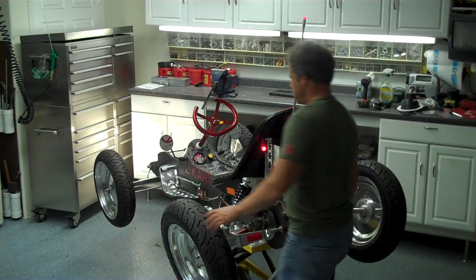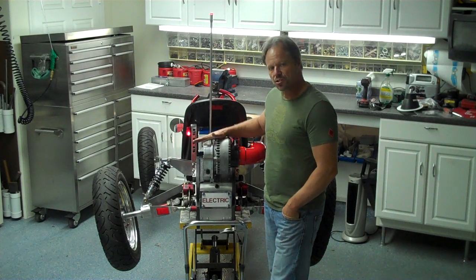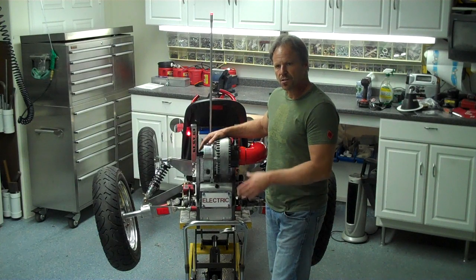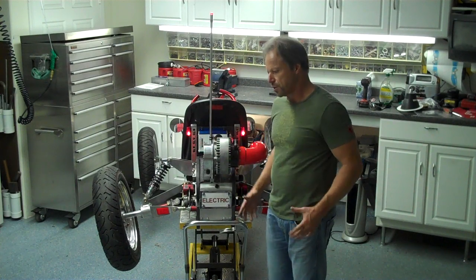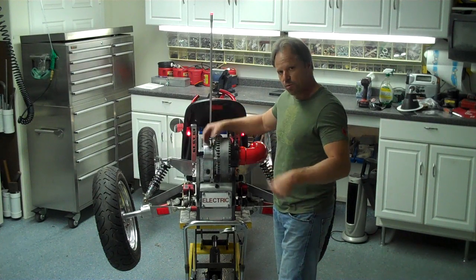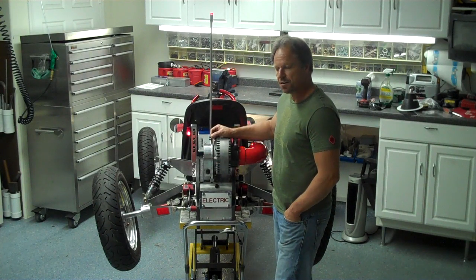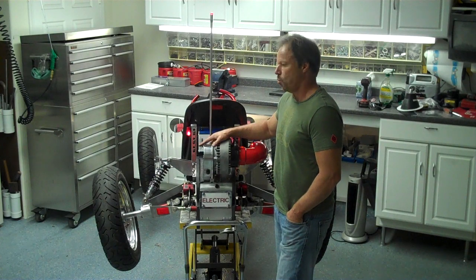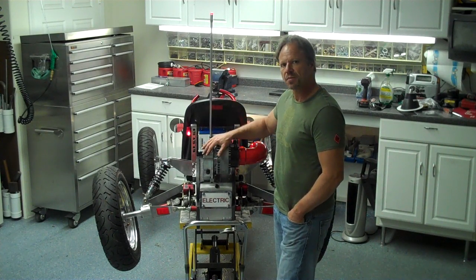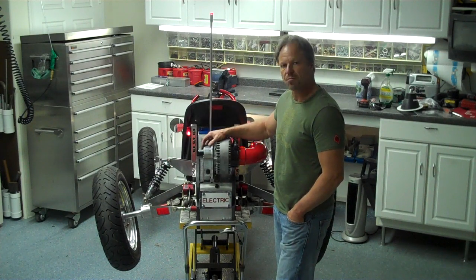On the back here, this is the motor — it's called an E-Tech motor. Briggs and Stratton originally designed this motor for floor buffers. If you go to a grocery store you sometimes see someone driving a standing floor buffing machine — that's what this motor was designed for. It has a lot of torque because it turns a big buffing wheel and drives the vehicle. It's a very efficient motor with very strong magnets inside. People have been putting these in motorcycles, so I figured why not make a small four-wheeled vehicle.